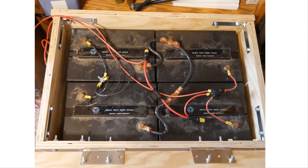I do something interesting here — you'll note there are two red cables coming in: one is for charging and one is for the load. If you don't do this, there are failure modes where the charge controller doesn't see a battery and you have the solar panel going directly to the load without the intermediation of the battery, which can cause quite a bit of damage to equipment. So I take the charging leads all the way to the battery terminals and then take the discharge leads from the same place, to reduce the failure modes where you might lose contact with the battery.